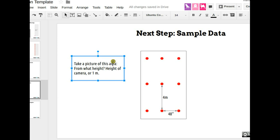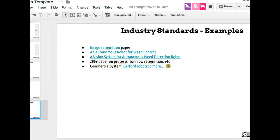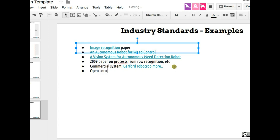You're saying that. For centimeter accuracy or precision, there's an open source GPS receiver. It was a start-up project. Okay, put that on the page. But I don't know what the prices are and if it's still available. It's from 2013. Oh, to 3 centimeter accuracy? Yeah, I think 4 centimeters in X, Y, and 8 centimeters in Z, in height. It's sort of a correction on the GPS signal. I don't know the technical specs or the price. It was for UAVs.